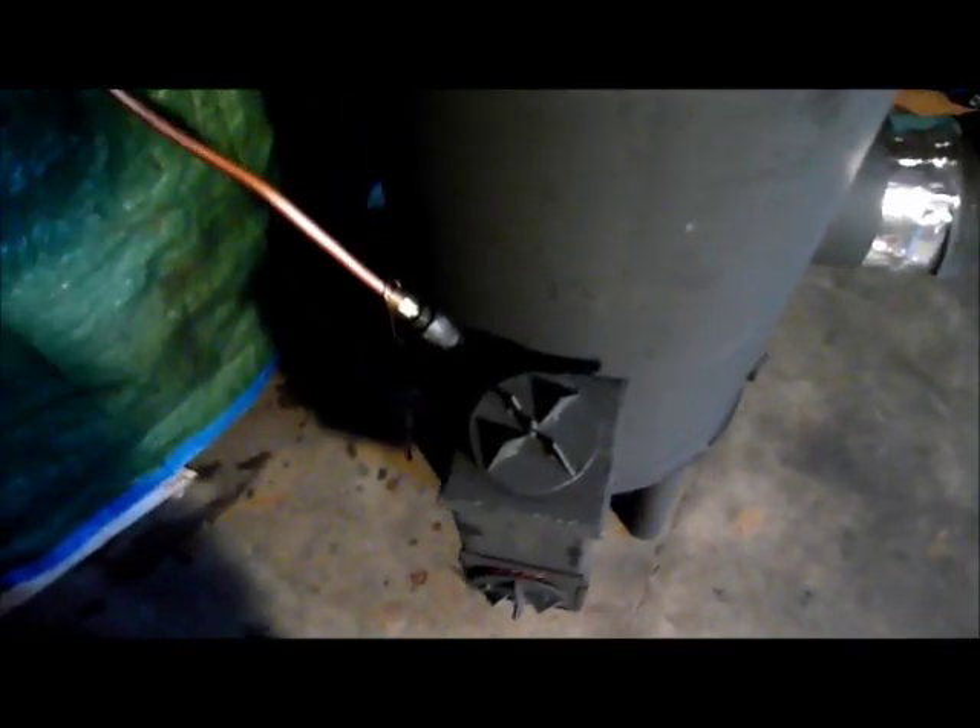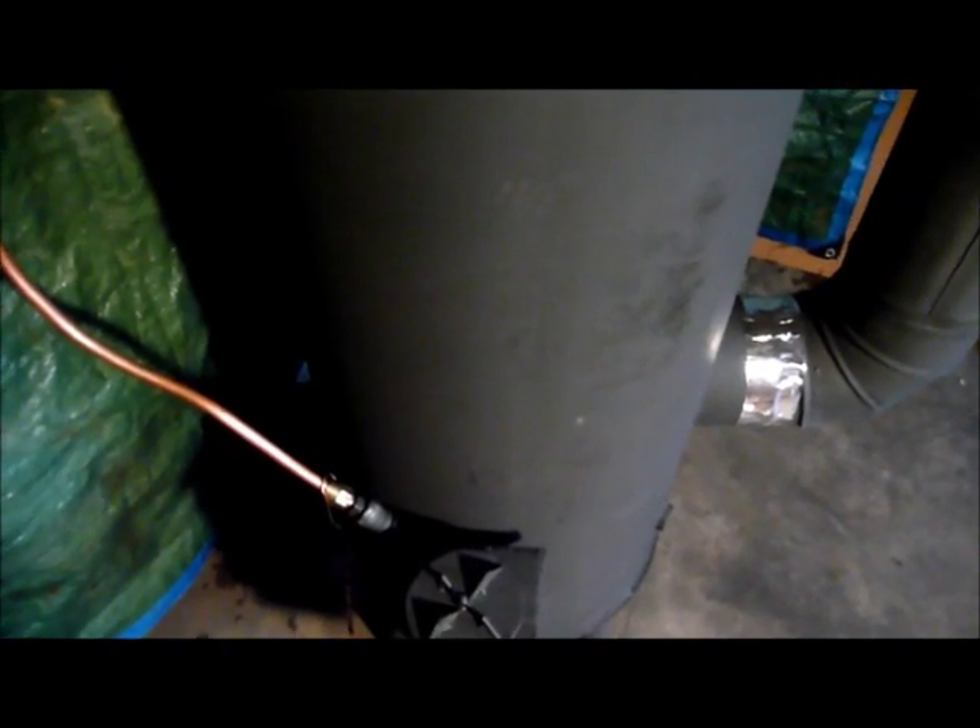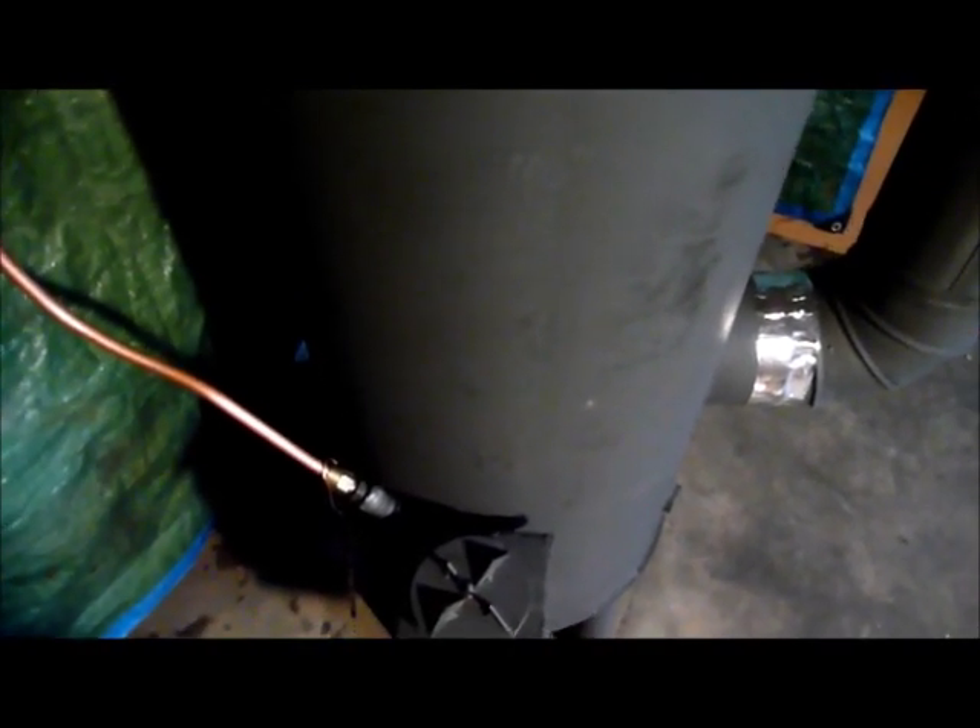It's been about 16 minutes. Temperatures: 264 degrees there up on top, 184 degrees, and the very plate on top is 236 degrees. Until this gets up to about 300 degrees it's just a slow go, but after 300 degrees it sort of takes off. And this is looking down inside the burn chamber — good draw, just burning straight waste engine oil.